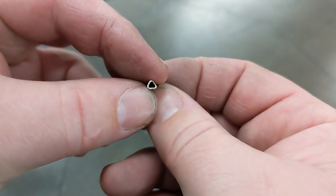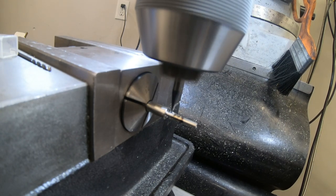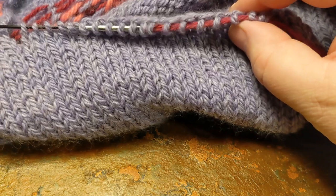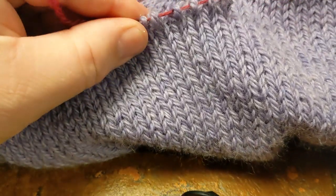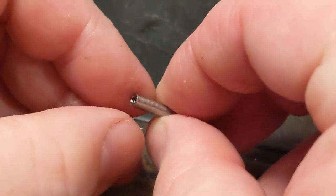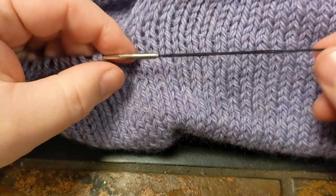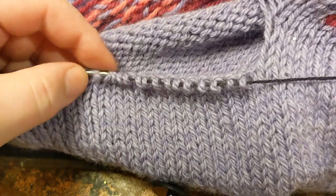I really need to get a collet attachment for my lathe. Mark III was the same thing all over again, only this time I pre-cut the grooves with an incredibly tiny 1mm end mill — managing to somehow not break it — then continued the groove all the way around the tip with hand files. This one worked… okay. If you tie the knot just right, the yarn is pulling more or less axially with the eye, but it still wants to twist sideways and jam. Getting a bit tired of the project, I tried one last idea for a Mark IV: having the attachment pull through the exact center by drilling a small hole all the way through, so yarn can be threaded through and a knot tied to keep it from pulling out. Except the hole was too small for the yarn I was using, so I had to use floss to thread through some sock-weight yarn instead. While theoretically sound, the end result wasn't really any better. I think I'll stick with the Mark III version, so I don't need to carry dental floss around in my knitting kit.